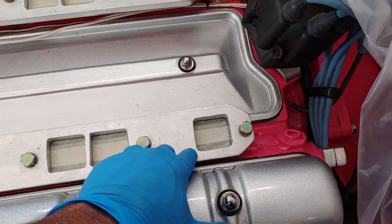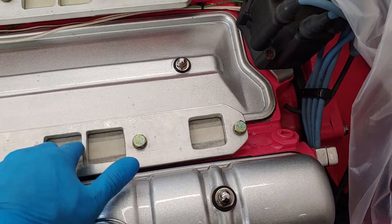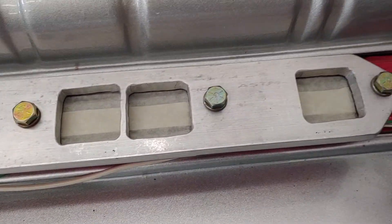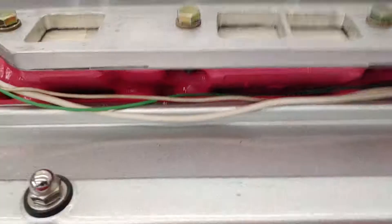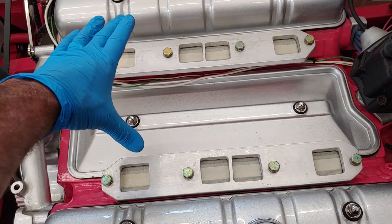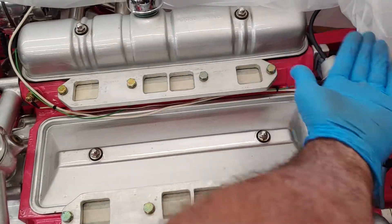By doing that I'm losing about one eighth of an inch on all four corners, so I have to fill this in heavy with weld on the corners — but we can handle that. By the way, those are half inch thick. So we're going to cut all the tubes right here about six inches, put them on a 45 degree plane, and then knock the tops off.